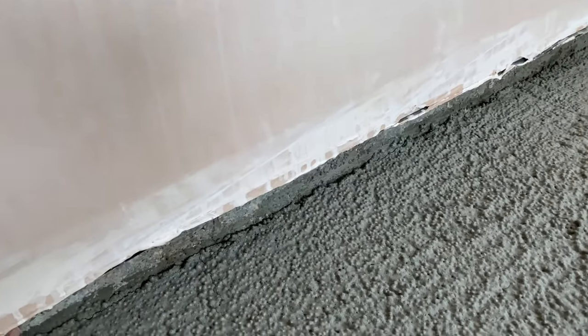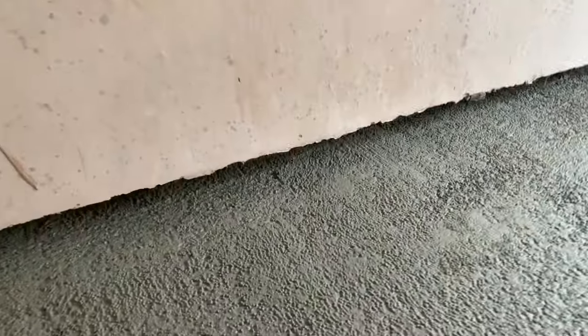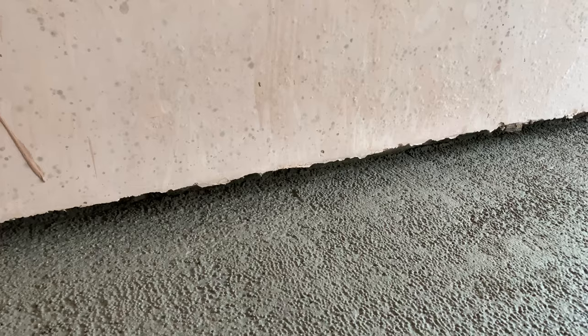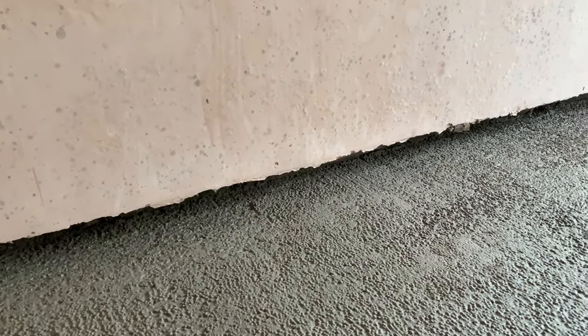And in some of the areas, particularly in this area here, where we did an upstand for our 6-inch wall for our bathroom and stairway, there's very little depth. There's probably only about 35, 40 mil, so you're talking an inch and a half of depth there. Whereas on all of the outside walls, you've got 102.5 mil, plus whatever little gap and undulation there was from the wall. So you've got all these different thicknesses.